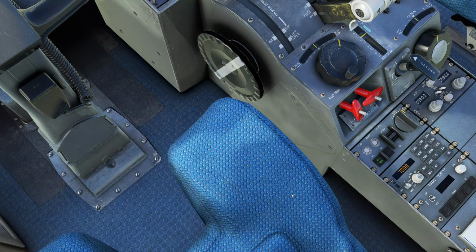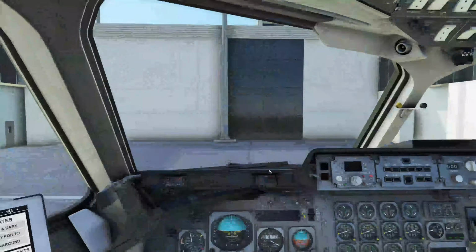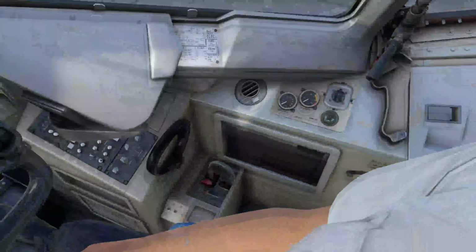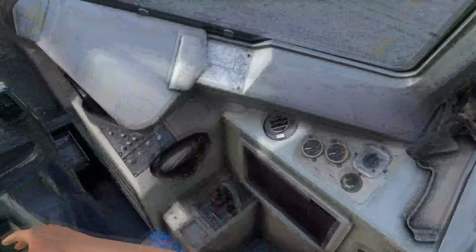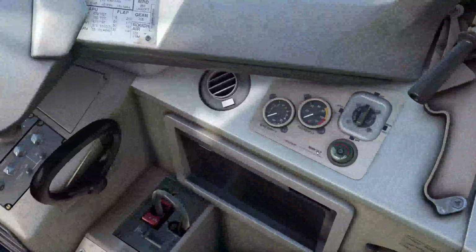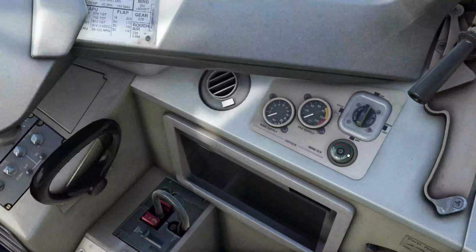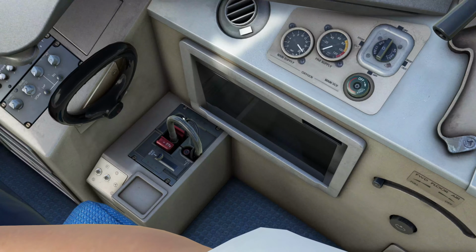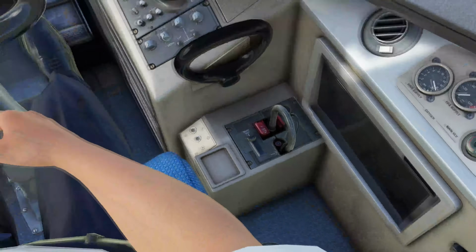And we're going to go over to the FO side. If we look down, sorry Roger, here's the oxygen panel, and we're going to turn the main valve on, and we'll see the oxygen system pressurized. This is for the emergency oxygen. There we go. It's all open, and we can come down and test his regulator. We got the test. We saw the little white X appear.